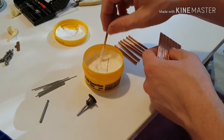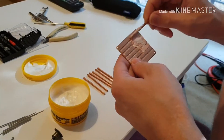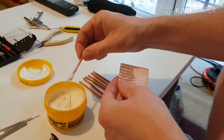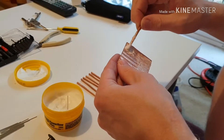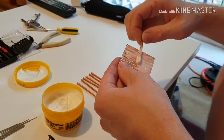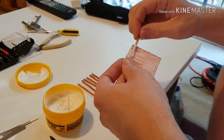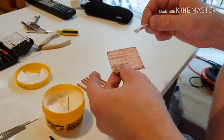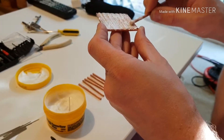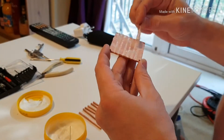So this is the process by which we flux all of these. I'm using a bit of copper pipe to spread the flux, making sure it gets a nice even coating over the whole surface. This stuff burns through the corrosion on the copper and makes the solder wet to the surface of the metal. You can never have too much flux — it's better to have too much than not enough, because you can always wash off the residue when you're done.